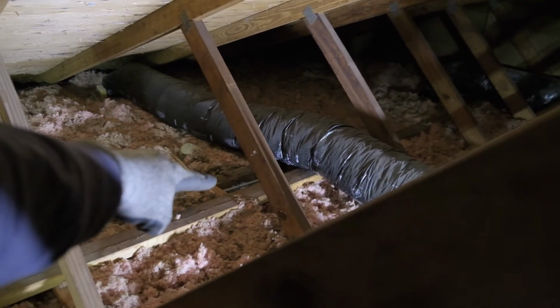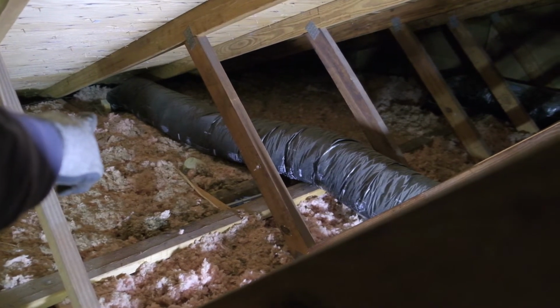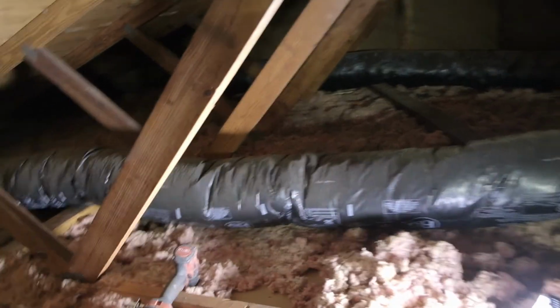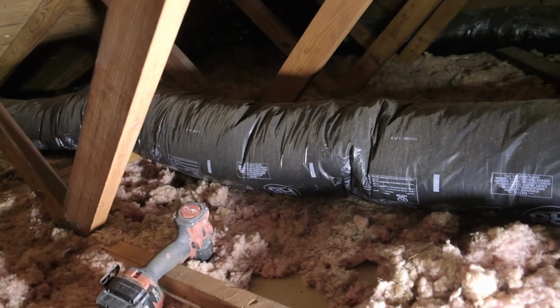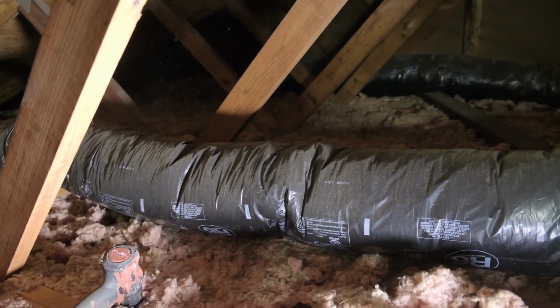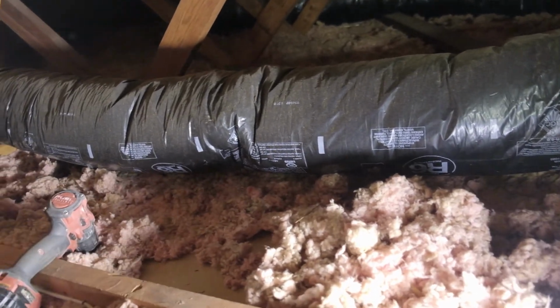And judging from where my ceiling fan is and the vent on the back of the master bedroom wall, it doesn't have to be square or straight or anything like that. It just has to work. But I need it to be right up against this joist so I can have something to nail into, because this house, built in the 70s, is 24 on center in the attic, and I have 14 by 14 boxes, so I gotta have something to nail it to.